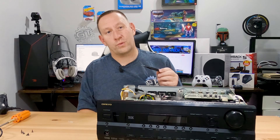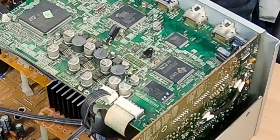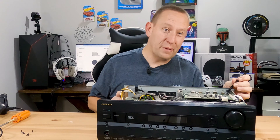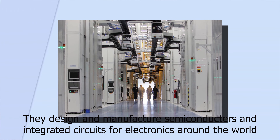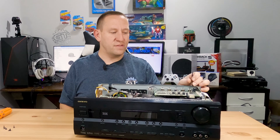They heat and they cool and they heat and they cool, so it creates stress cracks. I told you that mine stopped working when I moved — I think somebody probably dropped it and just stress-cracked something, and usually it's this DSP. It is known to be fragile, and it's not just Onkyo amplifiers that would suffer from this, because this chip is made by Texas Instruments so it can exist in a lot of different home theater systems. Even though the Onkyo ones are starting to get a reputation for breaking around this time because of these DSP chips.